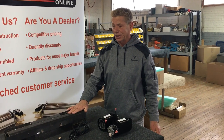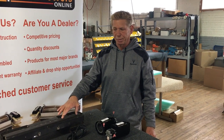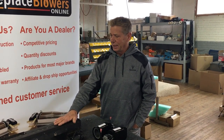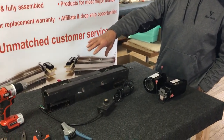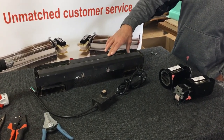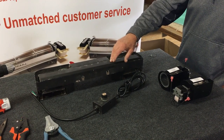Right now we're going to go ahead, start the video, and show you what it takes. We're going to take this unit apart, replace the blowers, and show you how to do it. It's probably about a 15-minute actual time spent replacing the blowers. We're going to bring our tech in — Jim — he's going to do this for us. To save a little time on the video, he's pre-drilled out about eight rivets, so we don't go through drilling all 12 rivets. We've got three or four left to drill out to get at the blowers.